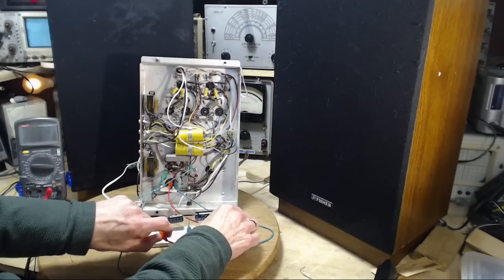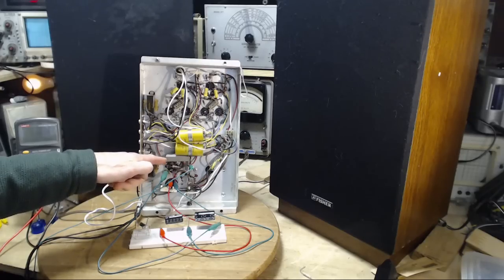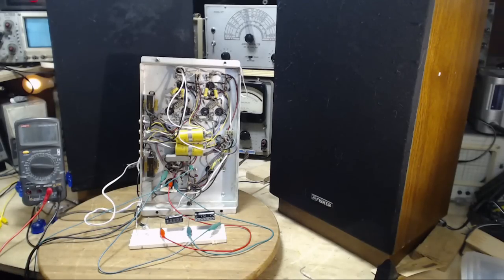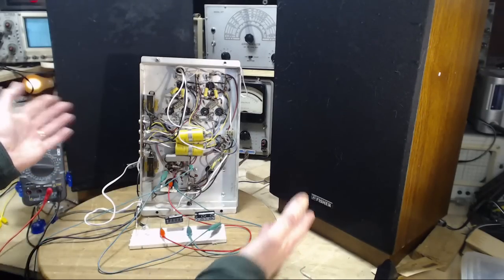Did you hear it? It actually did go up. I can certainly hear it here. So that was an increase in the hum. Now, these are 100 microfarad capacitors, and I just added 50 in parallel with them. Conceivably the hundreds had fallen off to 50s. I don't know if that can really even happen. And putting 50 in, we're back to 100, but we're hearing a hum.